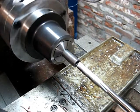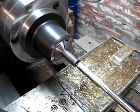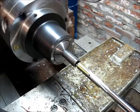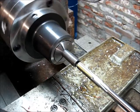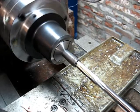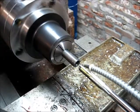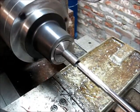All right, we've got a 3/8-inch reamer here in the lathe. Drop back to back gear, lube up heavily. This is a pretty substantial cut for a reamer, so we're going to take it nice and slow. And now your chips, retract often.